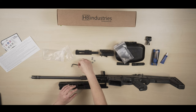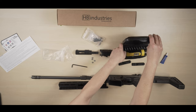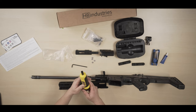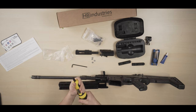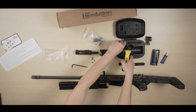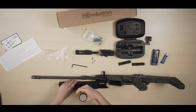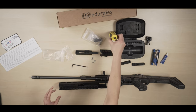Once it's snug, we're going to use the torque screwdriver — I'm using this fat wrench, it's pretty handy to have around. We're going to torque it to a maximum of 13 inch-pounds. I don't have the digital one right now, but that's about 13 inch-pounds. Then we get the screw bit and tighten this up. There you go — that's done.